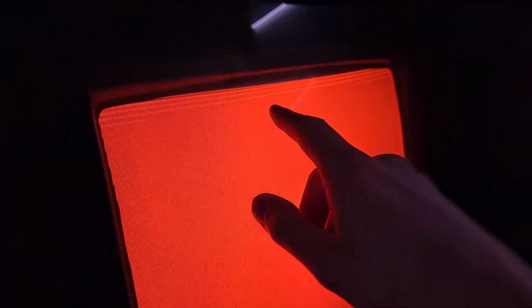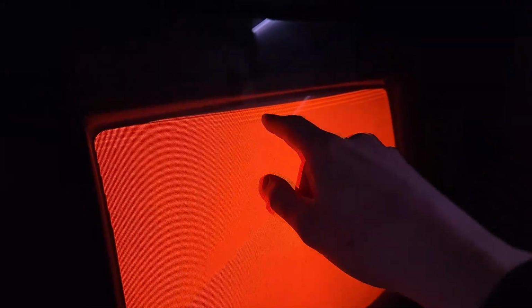Let's open up the coin door and go through test mode here. You'll see these brighter lines up at the top, and they're kind of squiggly looking. Those are not retrace lines, because you're not seeing it across the whole screen. That's foldover. As the beam is going back up to the top during vertical blanking, the beam is turning back on before it reaches the top and then starts coming back down while drawing.